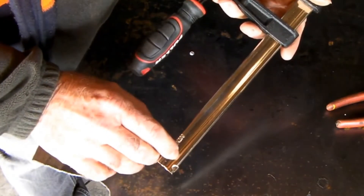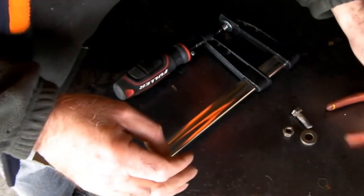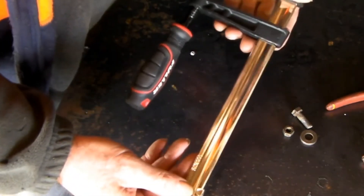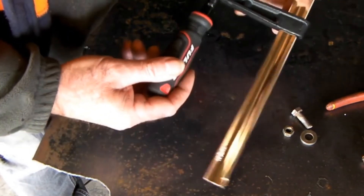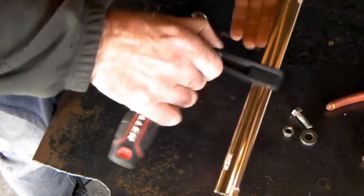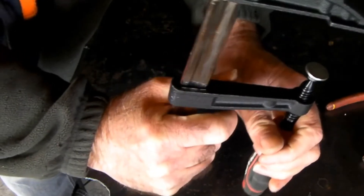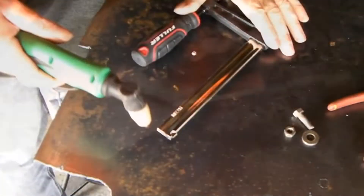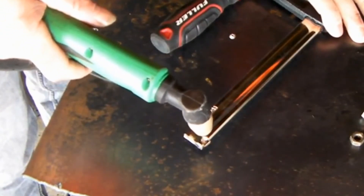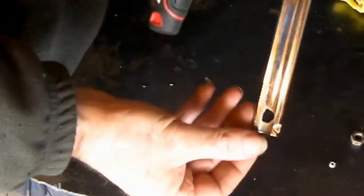Normally I'd say drill a hole in here and get the right size hole for the bolt you're going to use. But I'm feeling particularly lazy today, so I'm just going to get the plasma cutter and blow a hole in here. I suggest you put it right up the end because you never know in the future how wide a clamp you want to clamp onto — if you put it further in, you'll bugger up where you can put this clamp. So just put it right up the end. Not too bad a hole!